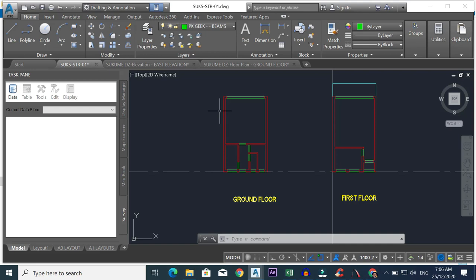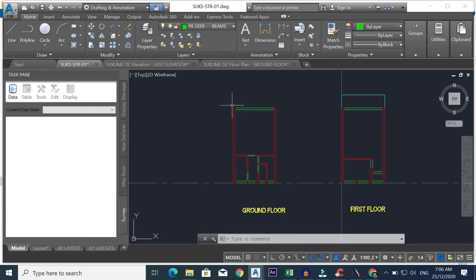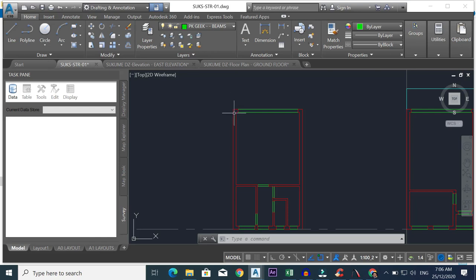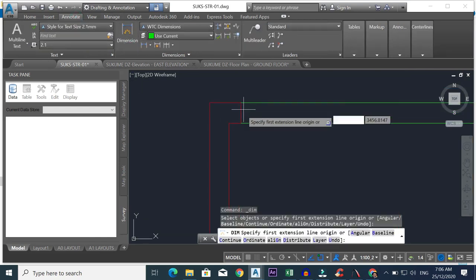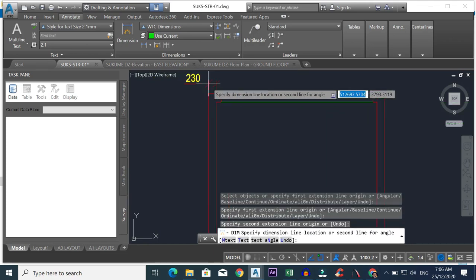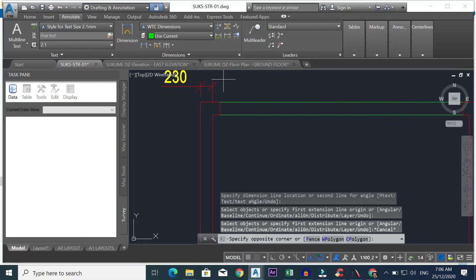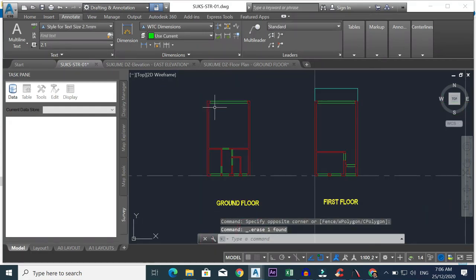So the first thing you're going to do, once you establish this, is to size your bases, or rather, the first thing is to size the column. What I'm thinking straight off the bat, since this is from Zimbabwe, is a 230 wall. So a 230 by 230 column for this one might be a bit small, because this is pretty long and this is pretty short.